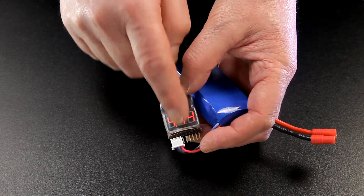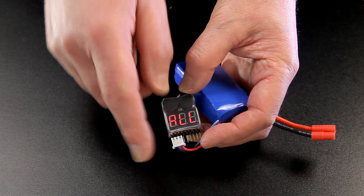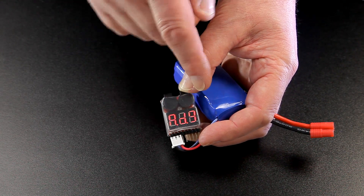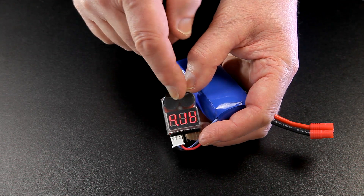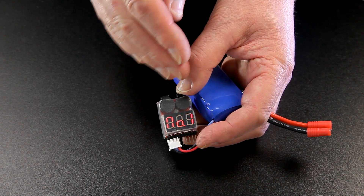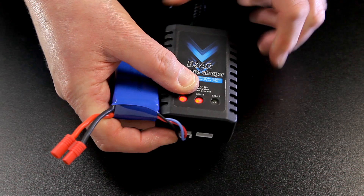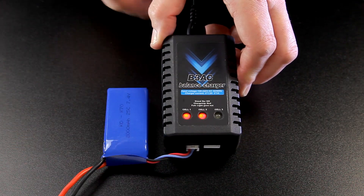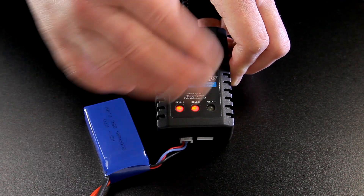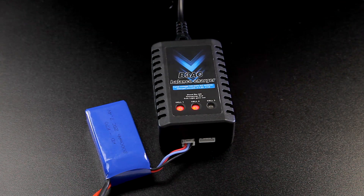You can use it as a low battery alarm on your quad, and it measures cell voltages — I've done a full review on it, link in the description. As you can see, this battery reads 8.33 volts total when fully charged it should be 8.4 volts — one cell is at 4.14 and the other at 4.19, so one is nearly charged and the other is a bit off. I'm going to plug that into the charger, connect to mains — it's better to connect the battery first then plug into mains — and leave it charging, then measure it afterwards.